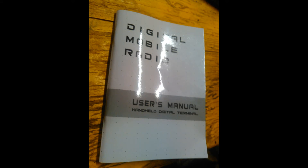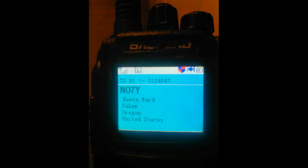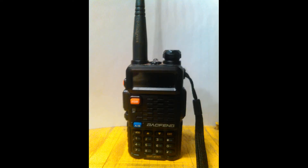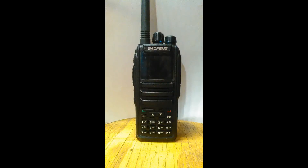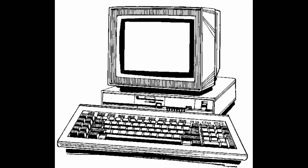There is new firmware I've installed that does allow showing names associated with IDs. Programming is pretty simple, much improved over the classic UV-5 series. You can change almost all the settings on the fly except for the DMR functions — you have to use a computer for that. I still haven't figured out how to program groups for DMR from the face of the radio; I ended up using a Linux program that downloads a text file for editing. Same goes for the ID of the unit. I'm starting to think it's just not possible without a computer.